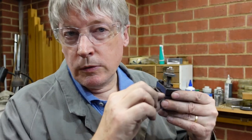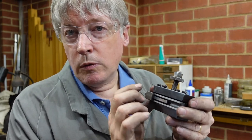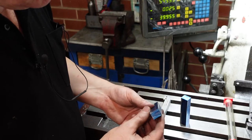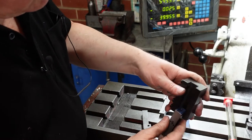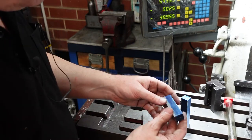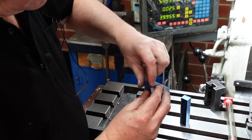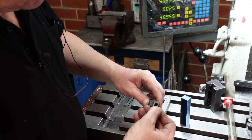To start with I'm going to take my material down to 16mm. I've got some black bar which is about 20 wide so I'll just do a minor cleanup on that. I've taken the blanks down to size and cleaned up all the faces. I've got my 16mm there to sit in my tool holder, and I've just done a minimum cleanup on the sides to give me something to work with. I've then scribed a line halfway along and that's going to be the height of my tool bit.